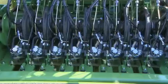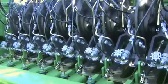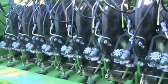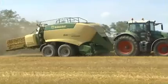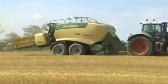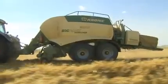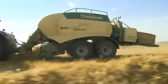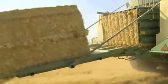This system comprises 8 slim double knotters. The individual threads are exposed to less pull and thus can hold denser bales. Another advantage is that the system can use twine that is not as strong but longer. This means BiGpack HDP2 is more economical and dependable.